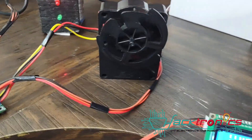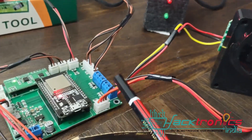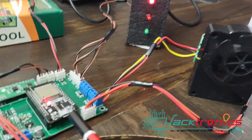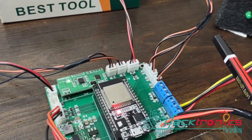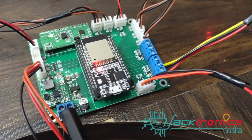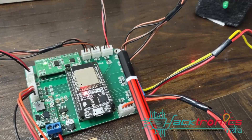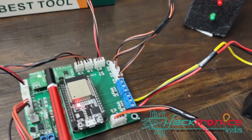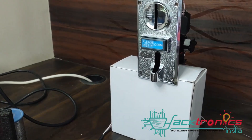The collect product LED is blinking. Now it will reset back to select your product. The third option is the coin acceptor. The coin acceptor and motor require a 12-volt power supply. You can connect a 13–14 volt lead acid battery to run the whole operation. It will automatically convert the battery voltage to 12 volts, and then convert 12 volts down to 5 volts for the RFID and other components.